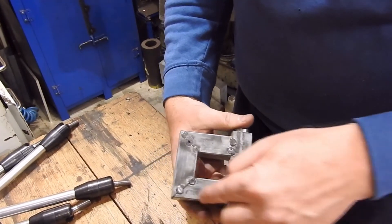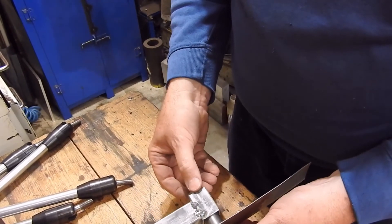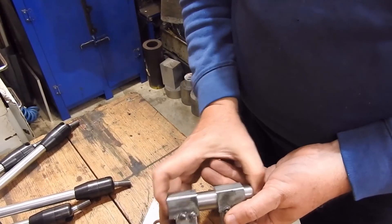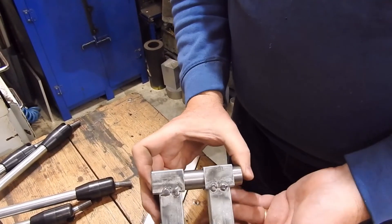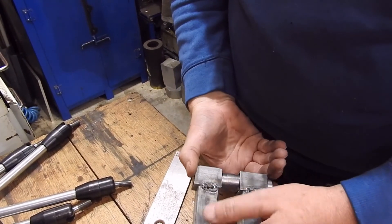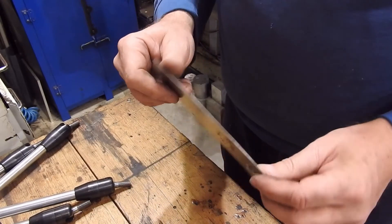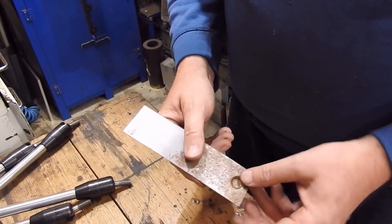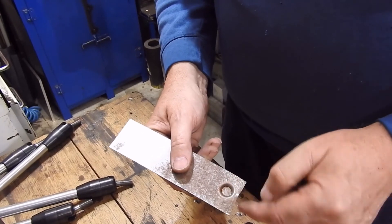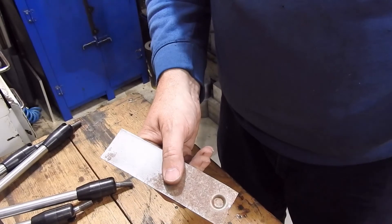With this one it should be noted that this frame is all it's doing is keeping these two halves of the die and the punch aligned. So if I take that out like that you can see that it just floats — and that's all that's meant to do. It was just a bit of scrap tube with a few gnarly looking welds. But that's the dimple you then get out of that. So I can put my little button magnet in that and that'll be flush with the surface. Use a bit of epoxy glue, seal off and Bob's your uncle.